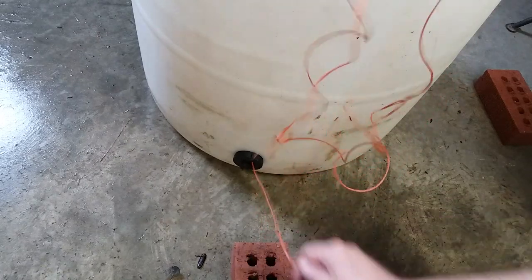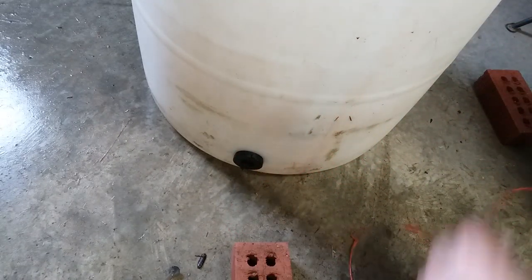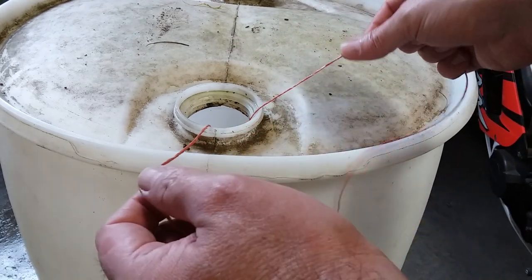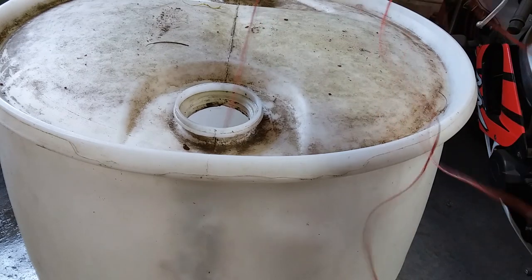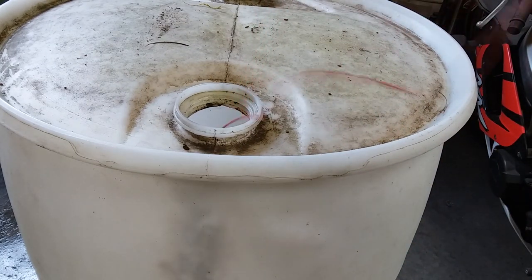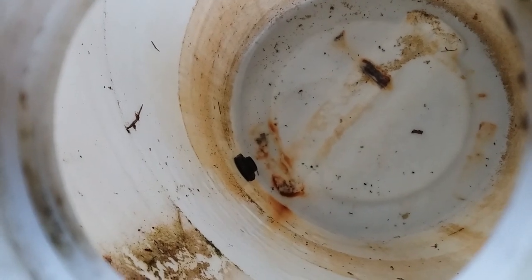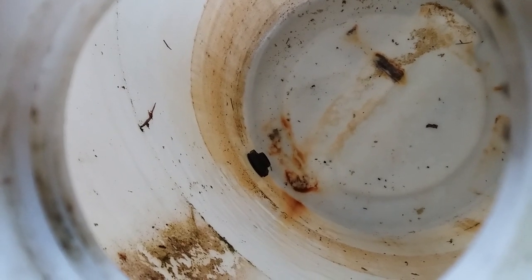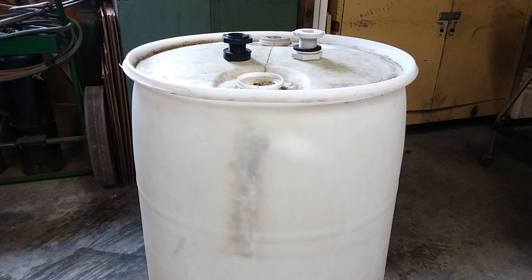Now it's all the way tightened. I pull the slider string all the way out. Up top, I let one side of the nut guide string go while pulling the other, and it pulls completely out through the hole in the nut. There's nothing left inside the barrel — you can see the nut is on the inside, everything is tightened and in position. The bulkhead union is in place, it's tight, and it's ready to go. If you liked the video, hit the like button and subscribe — I hope to have another video on rain barrels coming out soon.